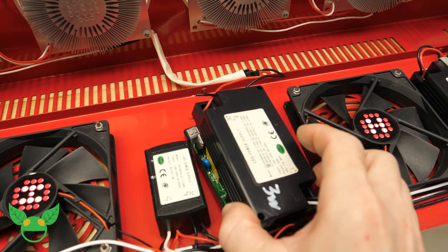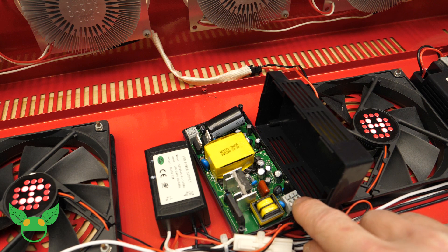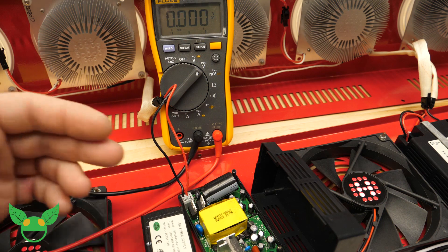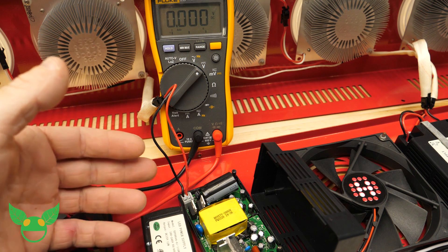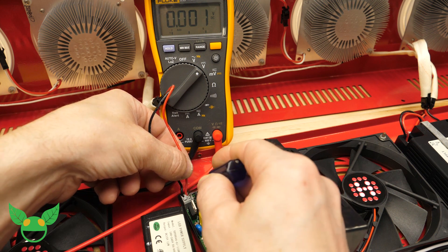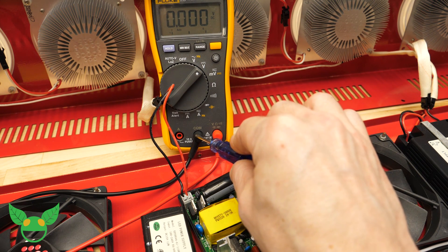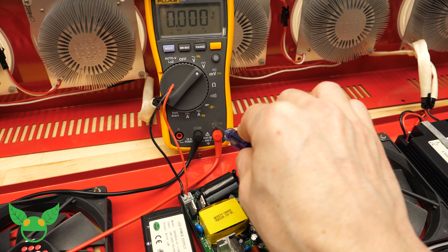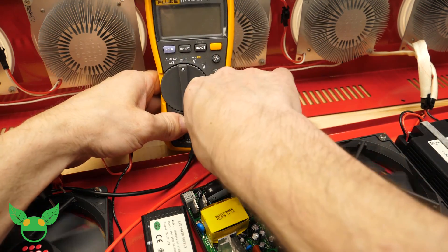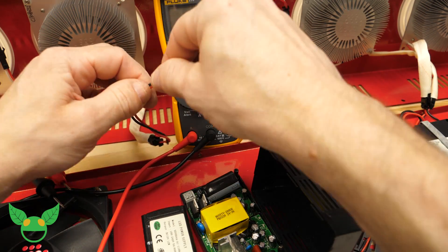The first thing we're going to check is the voltage of the driver. I've gone ahead and opened the plastic case for the top of this driver. You're going to want to be very careful of the AC-in portion — you're going to have mains voltage coming in there. Power it up only when you need to take your measurement. The ports you're interested in testing are the two ports with red and black wire, which denotes DC out. To remove the wires, you can simply depress these little buttons and remove the wires, or get your multimeter pins in those ports. There are three ports on a multimeter: one is common or black — DC negative, that one will stay. The one on the right is for voltage and ohms. The one on the left is for amps — it's a pass-through.